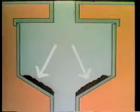Ash buildup is another problem in the bottom ash hopper. All bottom ash should be removed from the hopper when it is drained. Some ash may remain in the hopper if the spray nozzles are misaligned. If some ash does remain in the hopper, note it during inspection. The remaining ash will have to be removed manually. Early detection and correction of a problem within the ash hopper will avoid repeated manual ash removal.